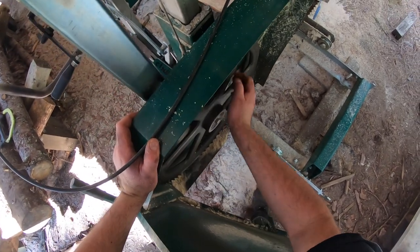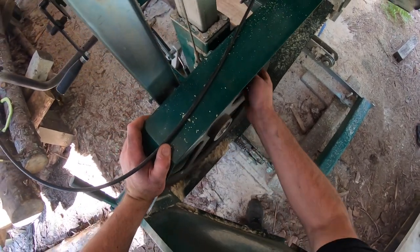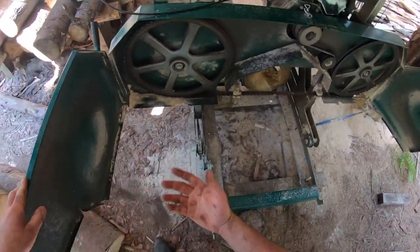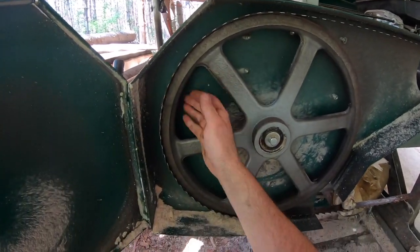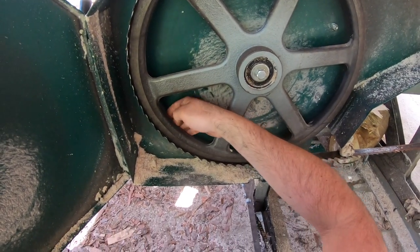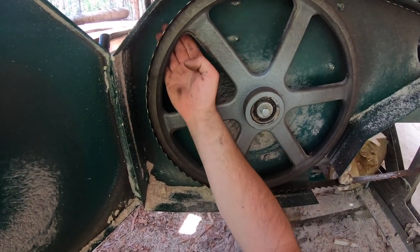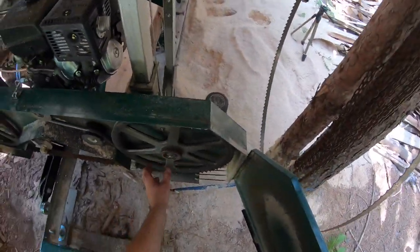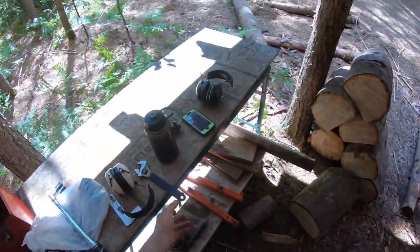It's actually very close. I'll spin it around a few times. With my right hand I'm running it along the back of the cast iron band wheel, feeling that the blade is flush with the back of that wheel. I check in this location and this location — I'm very close. This side you don't tend to adjust all that often, and that side looks good. This one is very, very close.